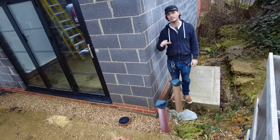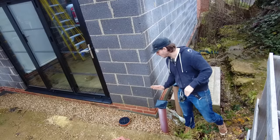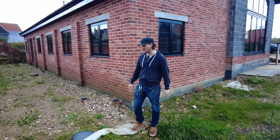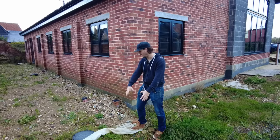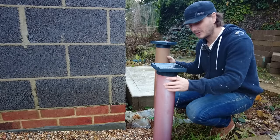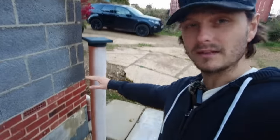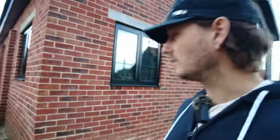My French drains run around the perimeter of the building. They start here — this is the highest point, the north-east corner. One runs that way all the way around, and the other one runs that way. On the opposite side of the building they've dropped below the actual foundation and they join up roughly about here. These are the start of my clean-out points — they are dotted around the building. This one is quite high because I'm going to have a deck here, so I'll finish it in line with the deck. It's something they do in America as well, just in case the drains get blocked — you've got the opportunity to jet it out with a DIY jetting kit.